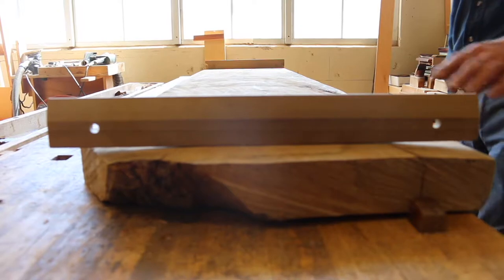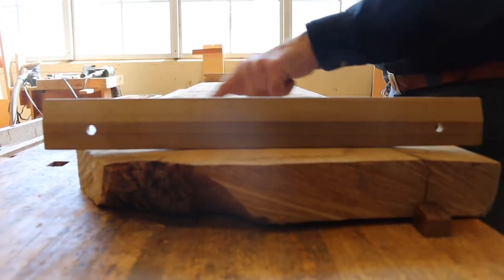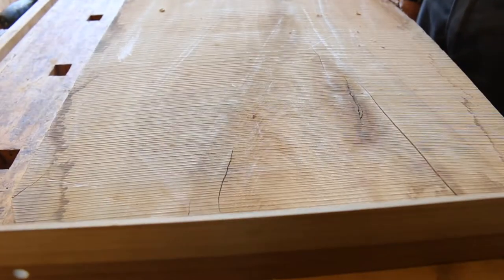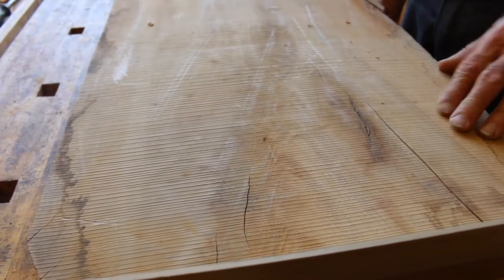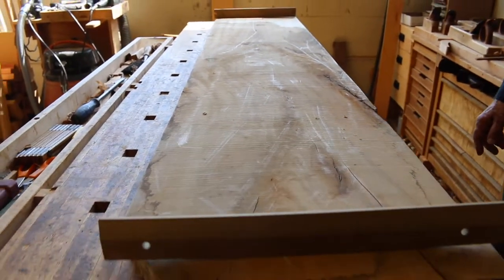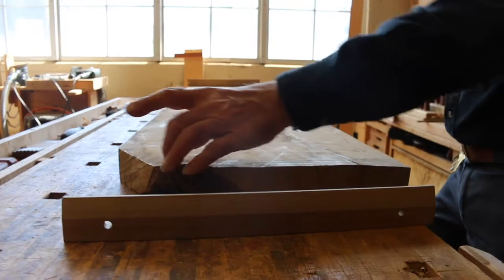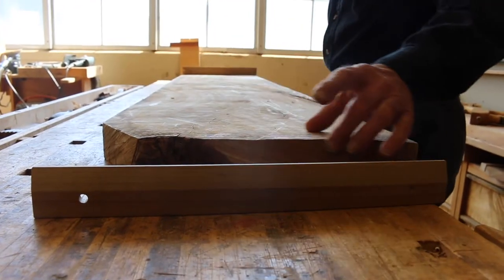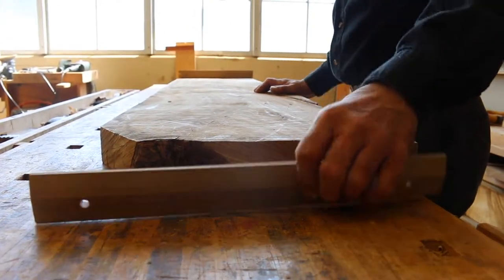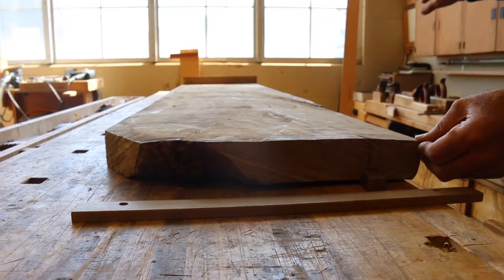It looks pretty parallel. I've got to lower this in here — you can see the light in here. Also I see the grain has got a bit of a crotch here, so this may affect which direction I make my initial cuts. I may have to rotate the board to get it in a better position. A board this wide you may have to rotate it regardless. My basic technique is to create a land — a flat spot on both ends that's straight across, level, flat across, and parallel to the far end, with a couple different ways of dealing with the area in between.